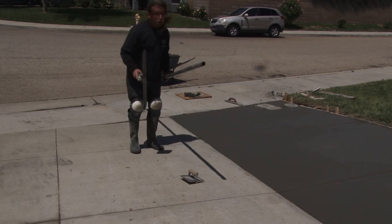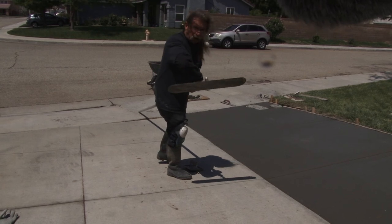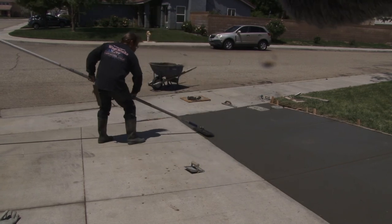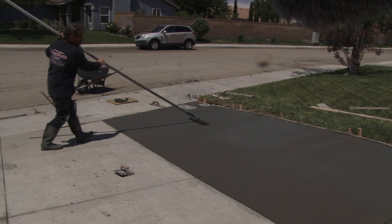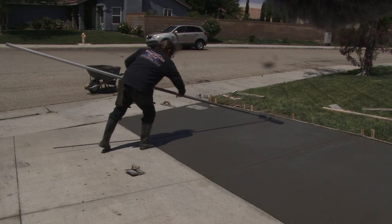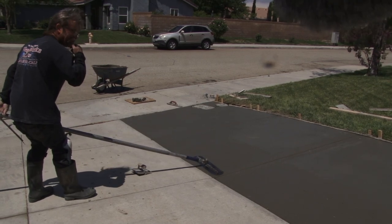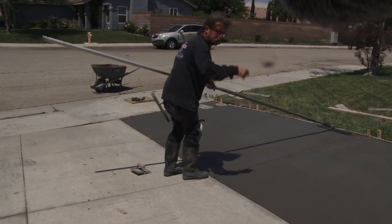We always want to keep our tools clean — the cleaner the better. If you take a tool with dry concrete on the bottom and put it on the concrete, it'll stick to it. It's almost tight enough to get on. I'm just getting the tool marks out. I'll chase that edge, then go down the middle and trowel that out. Then I'll come back, tune the edges up, and broom it.